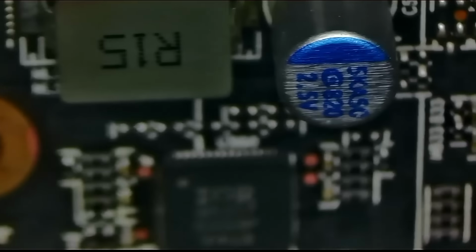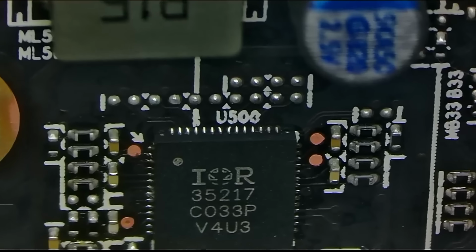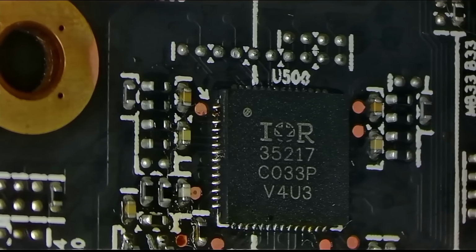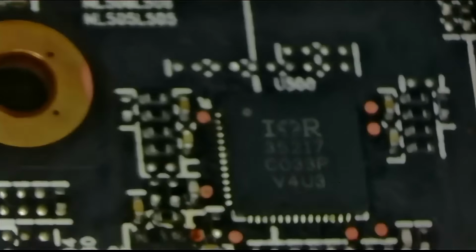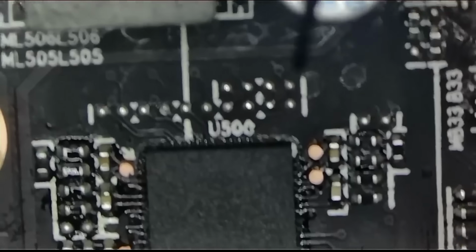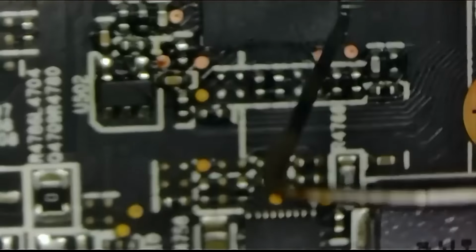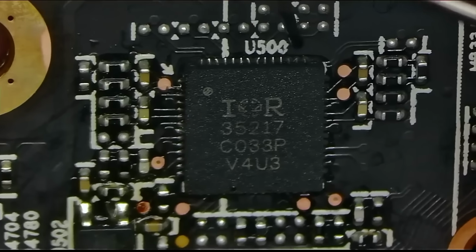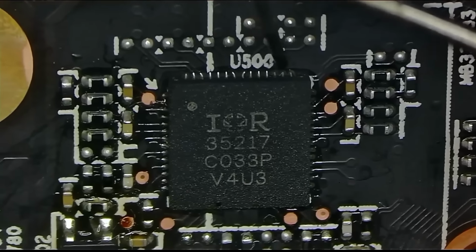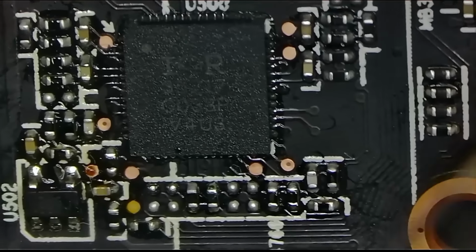It looks like I need to go to Northridge Fix and take some soldering classes, because my solder joints were not as good as they are right now. You can see that, especially on the cold side here, this would be the coldest side of the chip because it's the furthest away from the bottom of the PCB. So I had some of these joints, they were not connected.